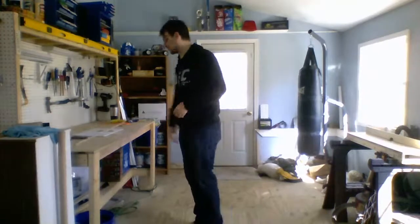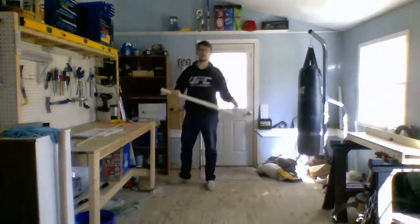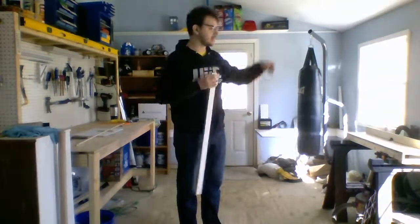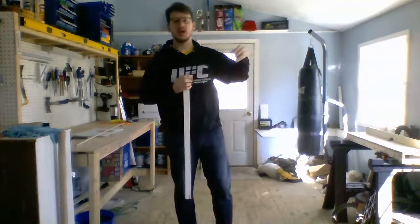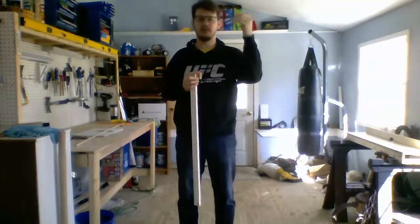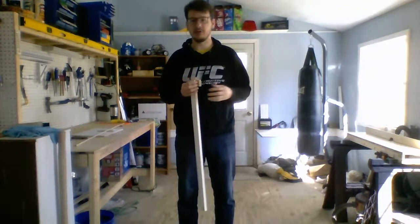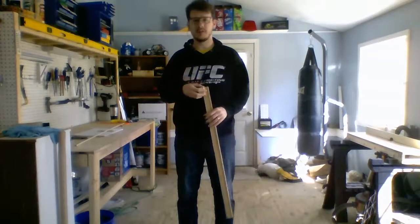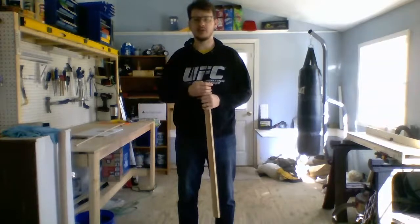Just wanted to show you something real quick to explain the purpose of the routing table. The way I have it set up right now, I actually have some pre-drilled holes in the back of the fence with bolts in it, so I can drop them in and make sure the fence is exactly lined up with where I want it to be every single time I'm going to use the table. Because the method I'm using, I got it off a YouTube video. I believe it's called "This is Woodworking" or something along those lines. I'll leave a link in the description after this.